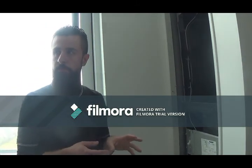So right now, the occupant is only going to have the heat option. Come, let's say, April, May, when you do the system changeover, they now have the option of cooling, once you've got the chillers on and everything. And you also have an auxiliary electric heater. So that is for, let's say in April, you decide to do a changeover and it gets relatively cold one night and somebody needs a little bit of heat. You've got that 1 or 1.5 kilowatt heater that'll provide a little bit of heat.